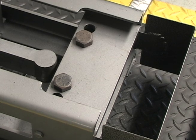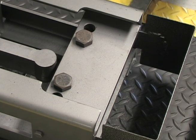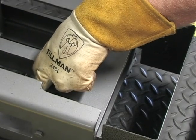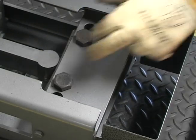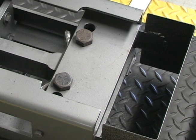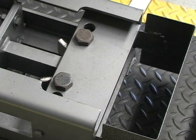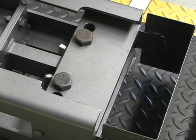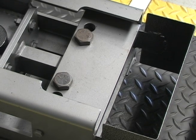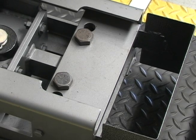Now, in order to pass a bend test, both test coupons have to bend. We're going to put them in this bending jig, bend them, and visually inspect them to see if there are any discontinuities. I turn the machine on, put my coupon in the bender, and then engage the ram to go ahead and make the bend. The purpose of bending the coupons is to open the weld up and place stress on it — the coupons are forced to bend 180 degrees. This test checks for joint fusion and penetration, and will also expose any potential discontinuities entrapped within the weldment. In order to pass, the weld should not break and we should not see any discontinuities larger than an eighth of an inch in any measured direction. It'll get ejected out here fairly forcefully.